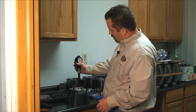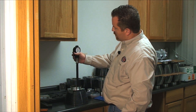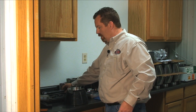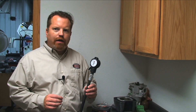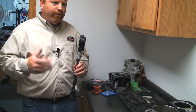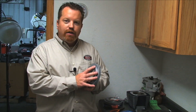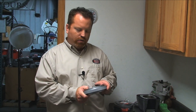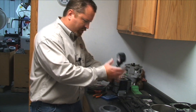Once you've checked it and everything looks good, you know you've got a good product. As you can see it's straight within a tenth all the way down, and around the bore it's within a tenth as well. There's a little spot that's a tenth and a half, but the more you touch it and check cylinders the more the temperature will change on it — and as I said, that's three tenths per degree. The gauges are very accurate, but sometimes as you use them they'll move a little bit, so to ensure proper accuracy use certified gauge rings — this one is certified to 2x, going down to a millionth.